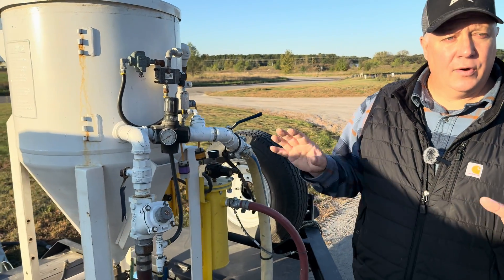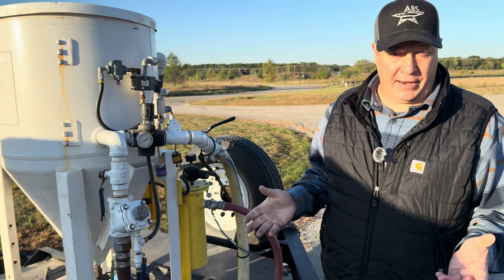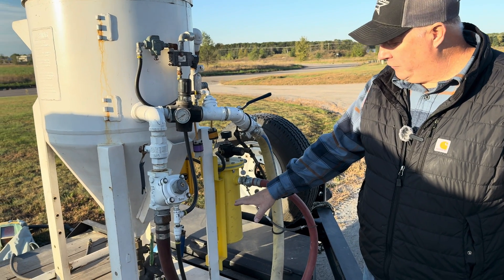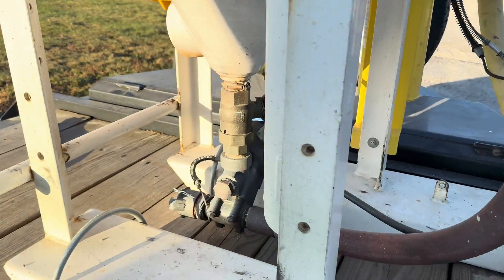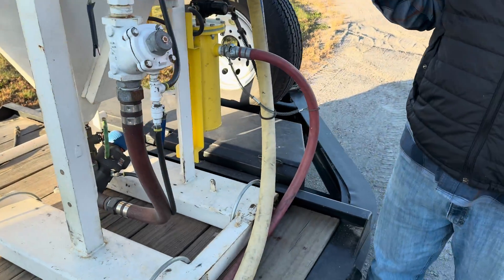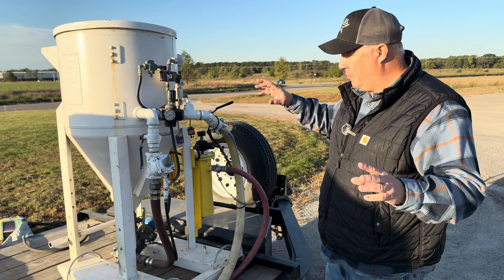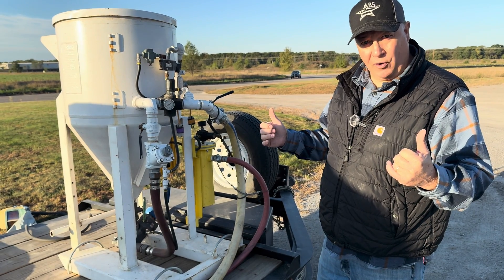Pressure regulator — we have this so that we can blast at low pressure should we need to. Today we're blasting big iron steel, we want to let it rip: 100 psi plus, as much as we can get. Our grit valve is preset. We'll get to that once we start blasting and can adjust the knob to fine tune — we want to listen for that whistle. Now let's walk around to the other side. We're ready to hook up our blast hose and helmet safety gear, and we're close to blasting this morning.